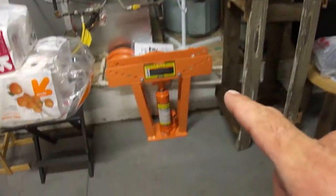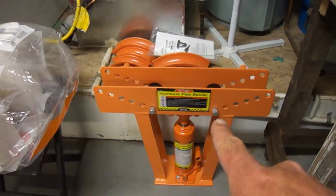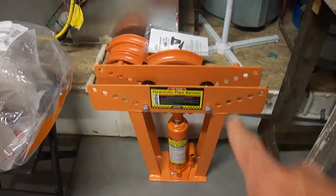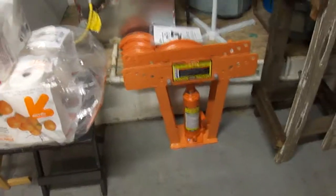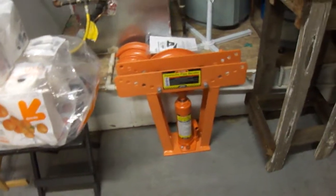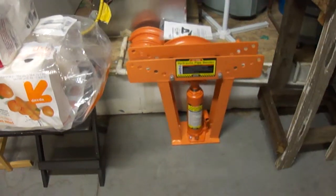So what I do on this is I move these studs right here. They're little poles. I move them up 2 holes with the wheels in there. And then I use the 1/2-inch eyelet, and that gives a good non-kinky bend. So it's a nice round bend. I think I have some bends I could show you right now, as a matter of fact. Doing it that way, you got some right there. It's not kinky. It's not kinky. What a shame, it's not kinky.